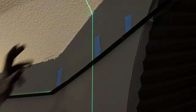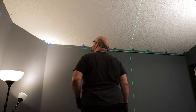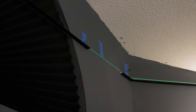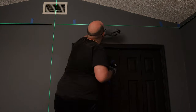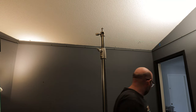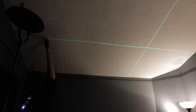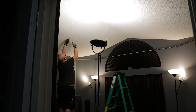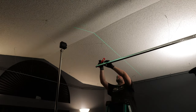The small piece connecting the two separate pieces near the front of the room went in easily. I wasn't too worried about any small gaps since the black ceiling tiles would mask that pretty well. On the last piece on the back wall, my hand slipped near the corner, putting two marks on the wall I'd have to paint over later. I then moved on to screwing the eye lag screws into the joists, missing a few because my stud finder kept going off whenever I held it. I put the hanger wire in each eye lag screw — I realized it would've been easier to add the wire right after installing each screw, but what's done is done.